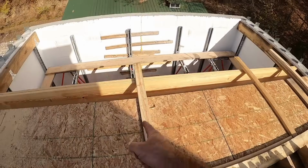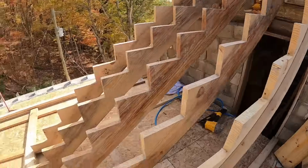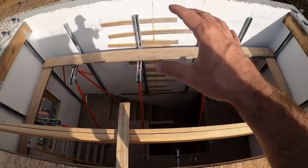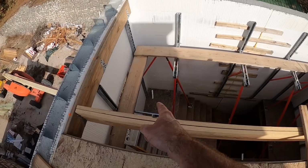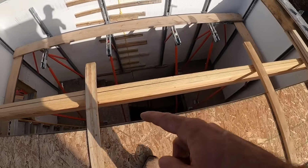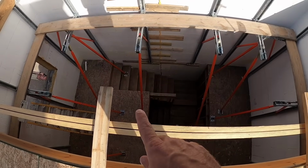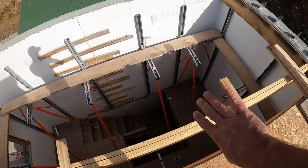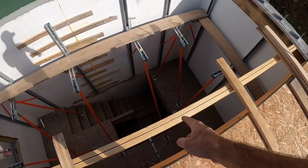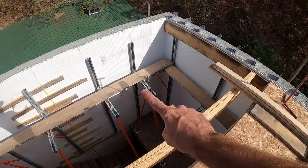But if this were to continue all the way out, now you guys can start to really see this wall is going to come all the way down beside the steps. Those steps down there, if I was to mimic the exact same thing, dump you out all the way over here in this corner. So I know for a fact I'm going to frame that little bit of subfloor closed right there where it is a header, bring it over about 10 inches, which shoves the entire staircase over against the wall. That's not going to be a problem because we've got a support wall underneath of it, and we've got double joists everywhere that we need them.